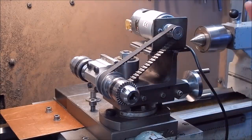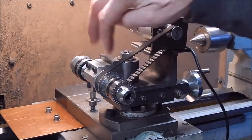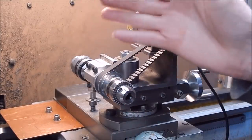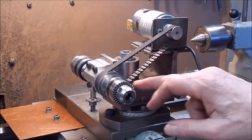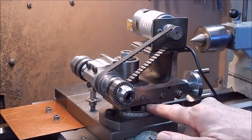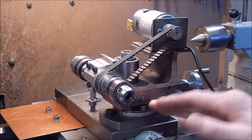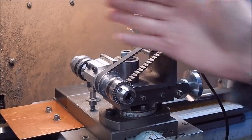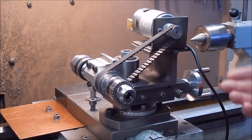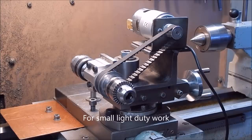You just take off the tool post mount, drop it on, and you're good to go. All you do is align your spindle longitudinally or crossways or at an angle, whatever you want. And as I said, you can do it with the unit, loosening off the pull down, or on the top slide by loosening off the degree plate and moving the top slide, so you can come in basically and drill in any direction. Drill, grind, cut off, you name it. This will do it.